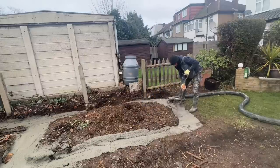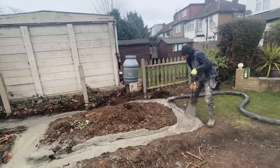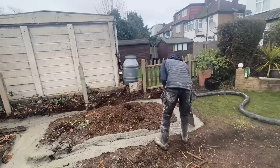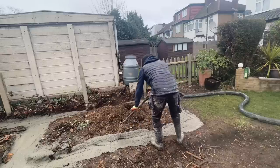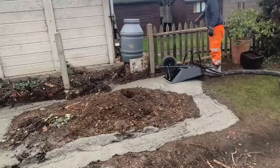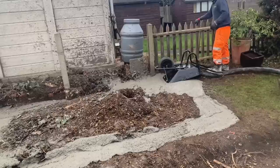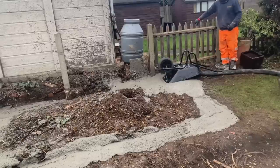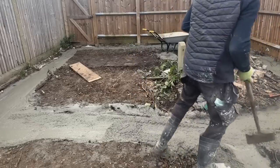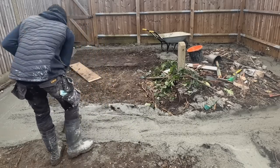I'm pretty much done now - concrete is finished pouring. The guy is just cleaning out the line, so what's coming out now is basically just whatever was in the line. He's also going to clean the lines out with a foam or sponge ball. High pressure air blasts the ball down the line and wipes the pipes clean as it's passing through. That's the final clean - you've got to make sure you're well out of the way for that because it can come out with a lot of force.